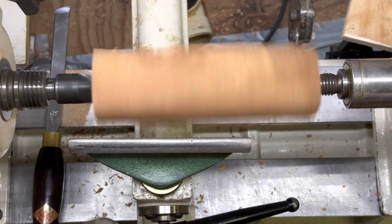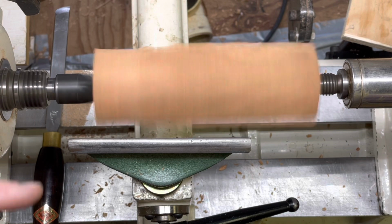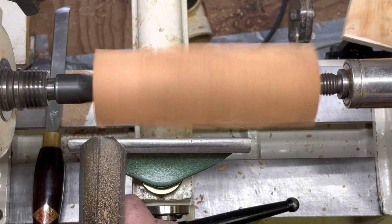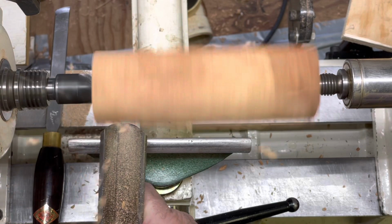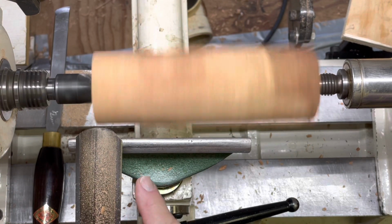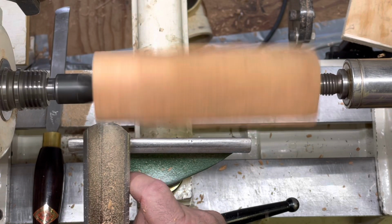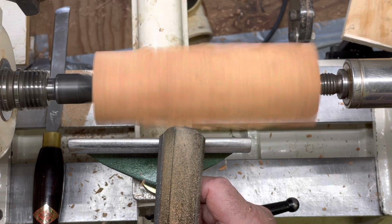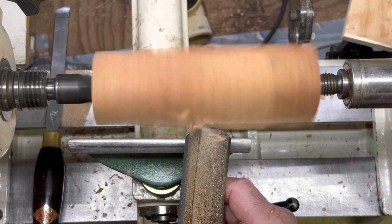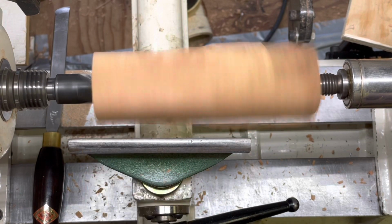The other thing is, understand that when most people look at that square, they're looking at the circle. The reality is the diameter is those 4 corners. I don't know if that makes sense, but it's a larger diameter than you realize. Depending on what you're seeing now on that camera, I'm not able to monitor it, but you'll see this is getting closer to round, and the corners aren't jutting as much. I have to start out farther. Just be aware of that.